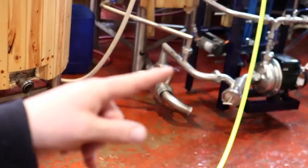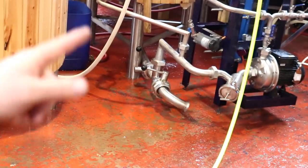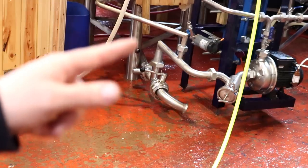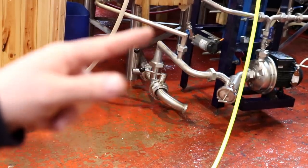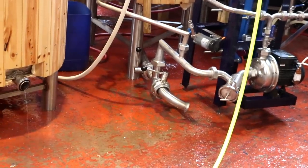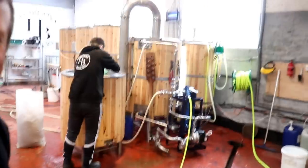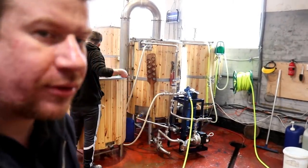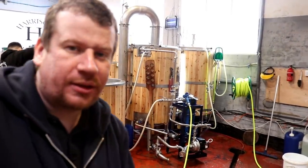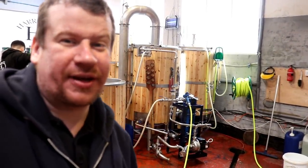And then this little section of pipework here, focus, this little section here actually needs to have an inch and a half elbow put on there to run across here, and that little bit there is not high enough, so there's a few little tweaks that we're going to have to do to this new fitting, but it's no doubt going to just save my back every time we go down there to drain the tank. It's just a lever now.